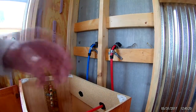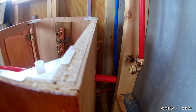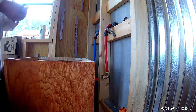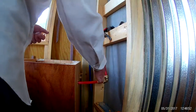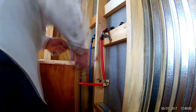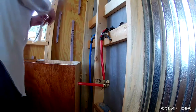I've got about that much pipe, so I'm going to make sure it's deburred, mark it, make sure we get the depth in there, and put in the stiffener. We don't want to forget the stiffener. Okay, we have a mark - stiffener goes in. Now we're going to connect this and push. Because of the angle it's at, I'm not able to get a good contact, so I'm going to take out the top one so I can push in this one a little easier. These disconnect tools are so awesome. There we go, perfect.